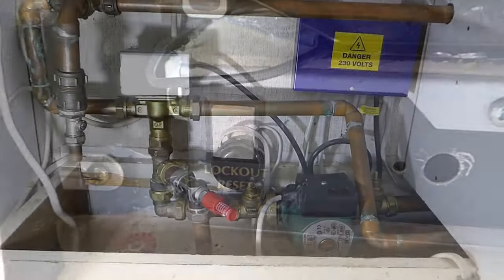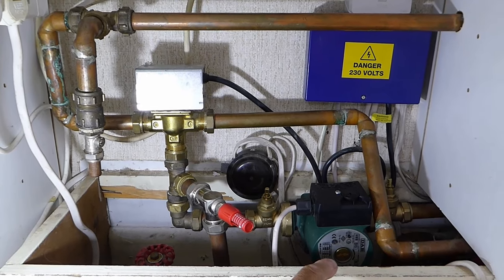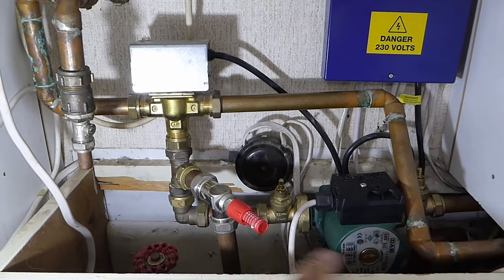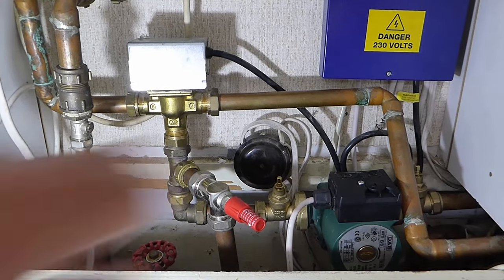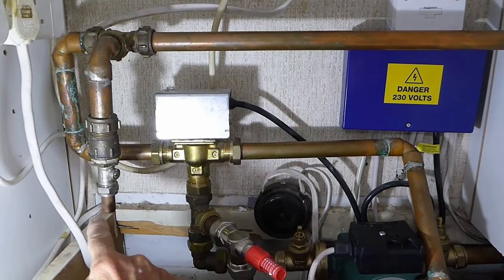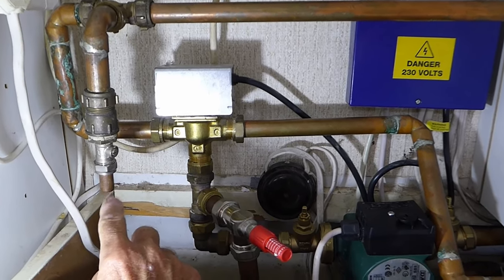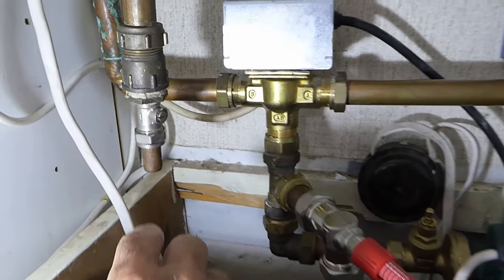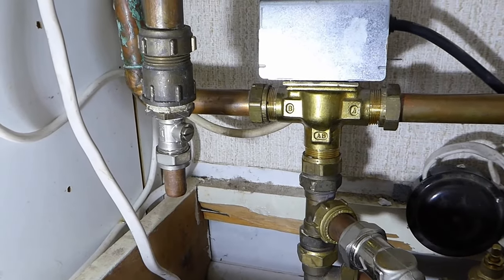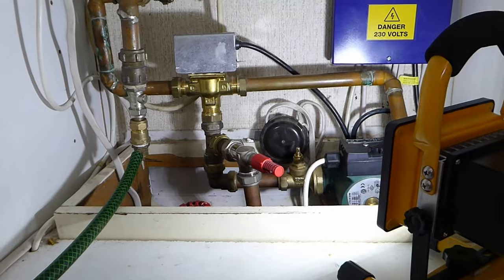Here's the setup in my cupboard. As you can see, there's a central heating pump. Because I've renewed the pump, I'm pretty certain the air is stuck in there along this line — it's risen up and is probably stuck up into this loop here. To get the air out, I fit a valve here, stick a hose pipe on it, open it up, and let it run for about a minute. Leave the cold water on, don't turn anything off, and it will drag the air that's stuck in that line out of the system and clear the boiler.